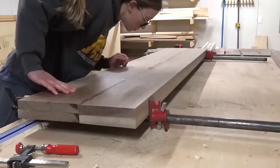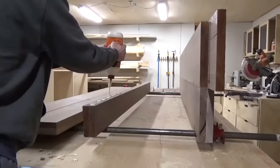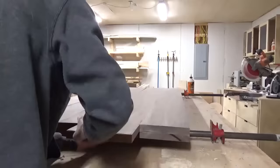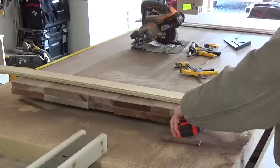When I came back the next day, I laid out these 2 panels and placed the thinner board between them on a couple of pipe clamps. I applied glue again to the edges and clamped these all together. I did everything in my power to keep the joints as flush as possible when I clamped them — including climbing up on top of it to hold down a slight bow. I clamped these nice and tight and let this dry for another 24 hours.